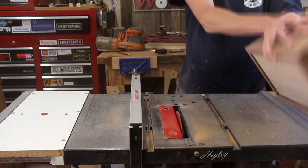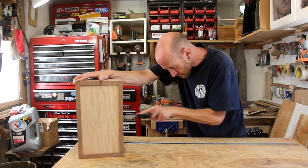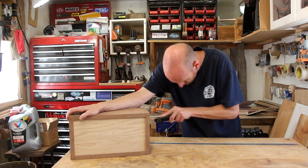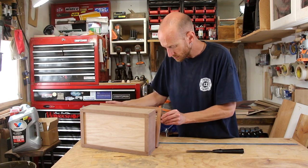This eliminates any flopping around or having to use any shims, clamps, tape, or any other devices to keep the lid in place. This is the thing I like. When you've made that cut on all four sides, you can just grab a handsaw of some sort and cut that thin sliver of wood away. Here I'm using a flush trim saw, but really any handsaw that'll fit in the kerf will work just fine. After you slice that last side loose, your top will now be free from the bottom.